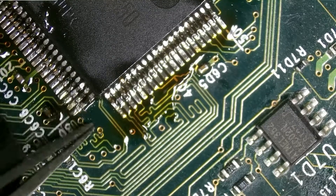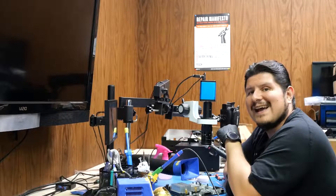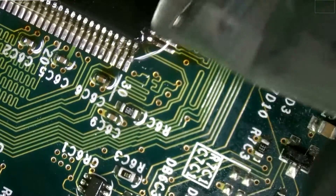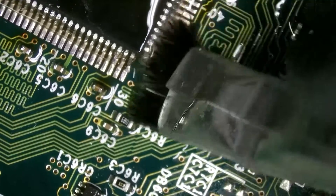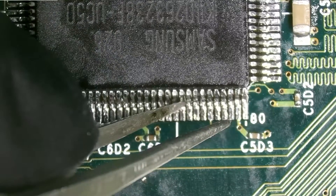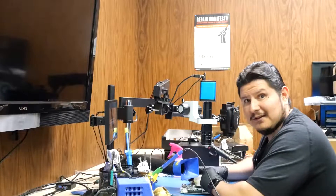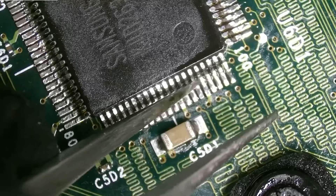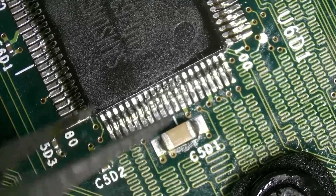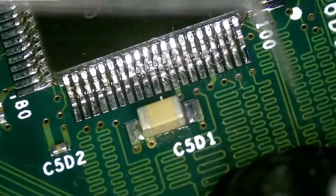Pin 28 is not touching — all good. Now we're going to perform the next most intense portion of this install: making sure all the pins are attached to the bottom chip. We'll do a little bit of cleaning, make sure we don't have any shorts, then attach that wire to pin 28 and hook up the Xbox to verify the RAM brick is installed properly. Some pins have moved on us, so we're going to straighten those out with our dental tool and re-solder them.